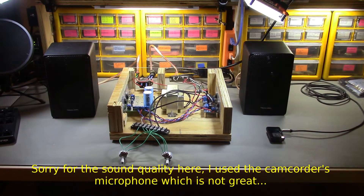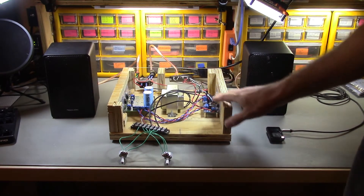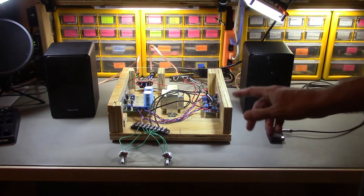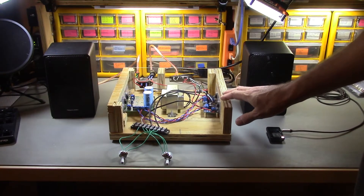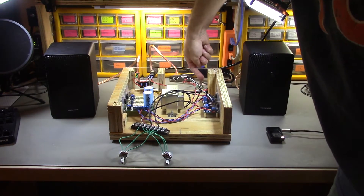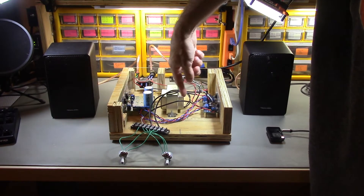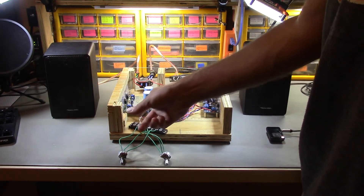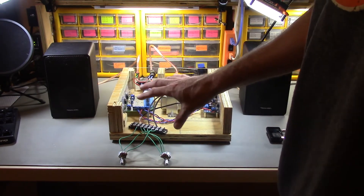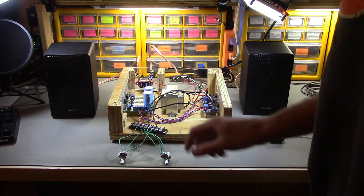Here is our test setup. I've completed quite a bit of the enclosure — basically pieces of scrap plywood cut up and screwed into place with wood screws. It's rough and ready but fits the DIY aesthetic. I'll talk about the enclosure in more detail in the next video. The audio input comes in through a 3.5mm headphone jack in the back, conveyed through a cut-up headphone cable — a shielded three-conductor audio cable — which is a good way to route internal audio signals and avoid picking up interference or 60Hz hum.